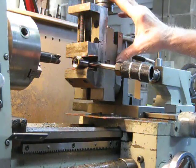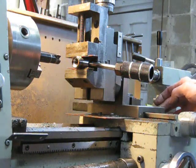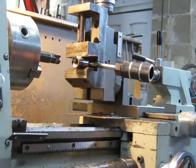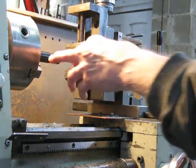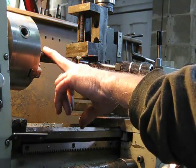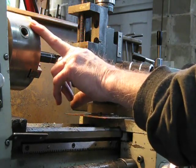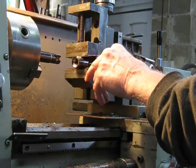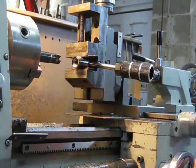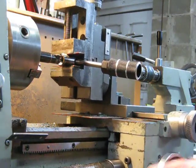So you position your vertical mill slide, put your job in it, get it all centred on both axes. Lock your cross slide, lock your mill slide, and then what a lot of people do is they put their drill, boring cutter, end mill, or whatever in the collet or the chuck. In this case it's a fairly easy job so I've just got it in the chuck. Then people just wind the old handle up and bore their way through it — but it's not really the way they should do it.